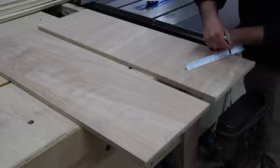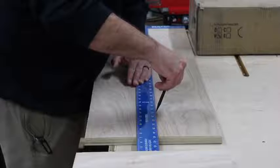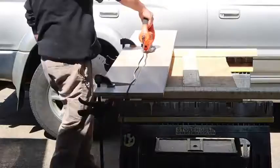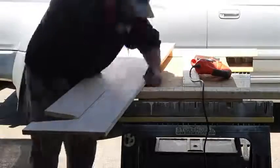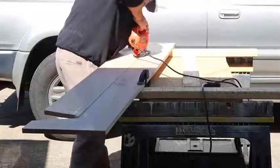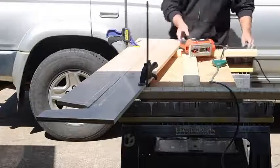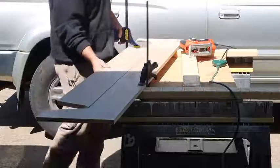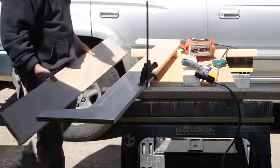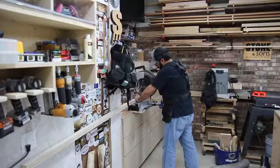The first thing I do is just break down all the plywood, and then I'm gonna add some design elements into this bed, making all of it out of plywood. I'm gonna be adding in some angled legs and cut out all of the sides and ends with a jigsaw to give me my leg profile. One thing I learned through this whole process was that I needed to just trust the jigsaw and let it do the work — I tried to rush a couple of cuts and my blade started wandering. You just have to let the blade do the work and guide it along the path.